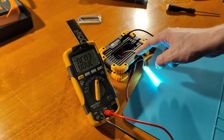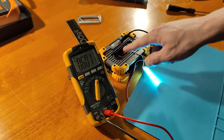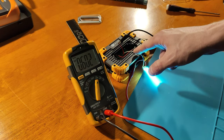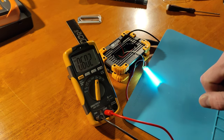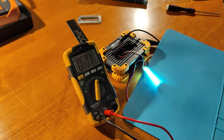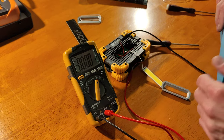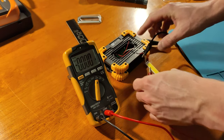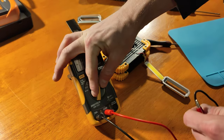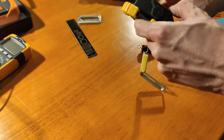So this is closer to one or two watts than it is to 350 watts. If it was 350 watts, these wires would melt. That circuit, which is probably rated for 1 amp maximum, would melt through - and it'd be a lot more expensive. If you look at some actual 350 watt COBs, they are big beefy units with a lot of individual LEDs in there. So yeah, that's certainly not the case here.